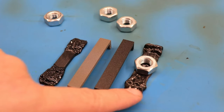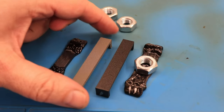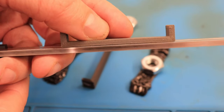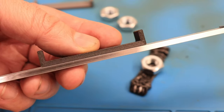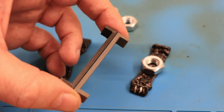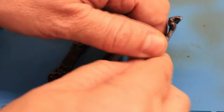After the test: this is Co-PA, this is PA12, and these two are PA6 glass and carbon fiber and they are almost completely undestroyed. The glass fiber is a little bit more deformed than the carbon fiber version. The first deformation occurred at approximately 150 degrees Celsius for PA12, then Co-PA at 165, and I couldn't notice any deformation on the two PA6 filaments even up to nearly the alarm temperature. Now trying to remove the nut.